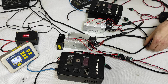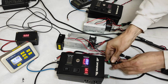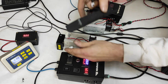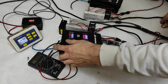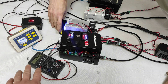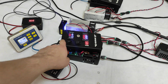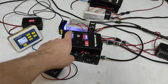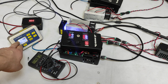Okay, we turned off the previous one and we will turn on this one. Sorry for a lot of wires. You see the temperature will go down now. We will also add a multimeter so you'll be able to see the current. We are ready to turn it on. We will see here — not voltage, but current. You see they're a little bit different because one measures on the diode, this one on the exit of the DC. It's very important that you have some losses on wires, so the same diode on the same current — voltage is different but current is the same — gives less laser power output.